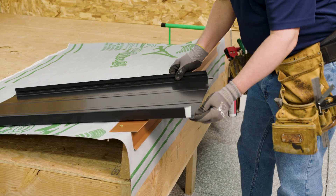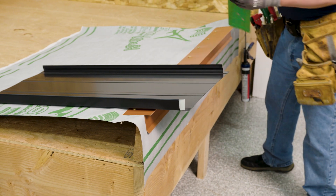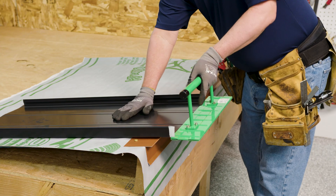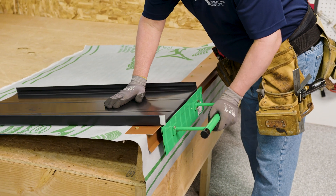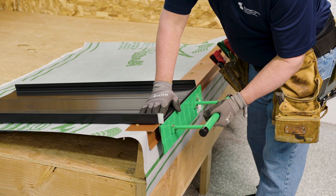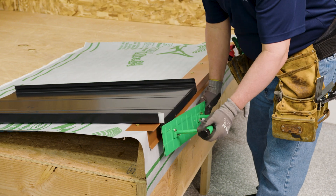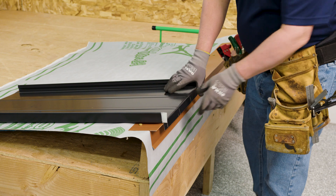We have the field of the panel notched down to one inch. Take a bar fold — the bar fold goes on and then we just fold that down. This will be 90 degrees. If you're thinking about the overall panel, we're only showing a short panel here, but this could be a 10 or 20 foot long panel.